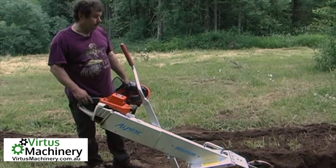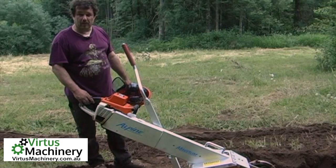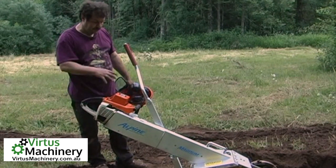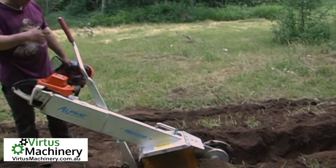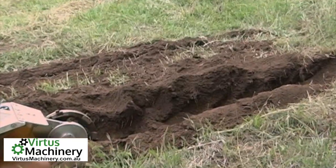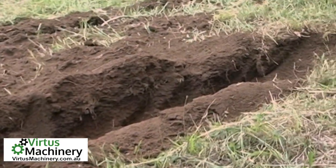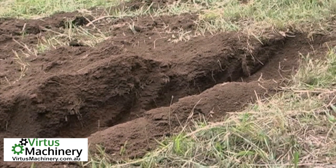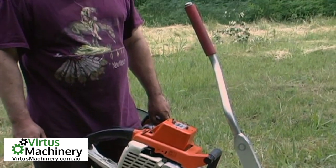That's how you can put about a 12 inch wide trench in 6 to 8 inches deep real quick, using the aluminum leg with that blue pivot disc. And you can see how fast I can mound up dirt over here, and then what I can do is kick it off with the cutter wheel and keep on cutting. You make a little pull back on the machine, skid the leg back a few inches, take another cut, and it works pretty easy.